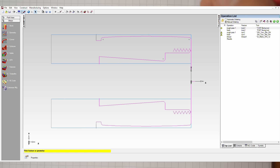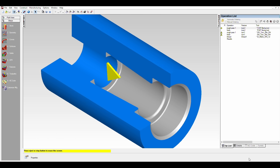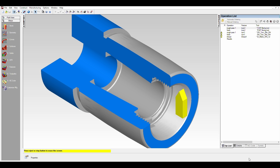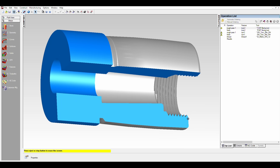This should work fine on a CNC. Let's draw up the tool parts and see what it looks like. There'll be four tools: boring — including the relief for the threads and the taper — turning the outside, turning the thread, and finally parting off. Pulley diameter is 42 millimetres, but if we have time we'll cut a second one at 35.